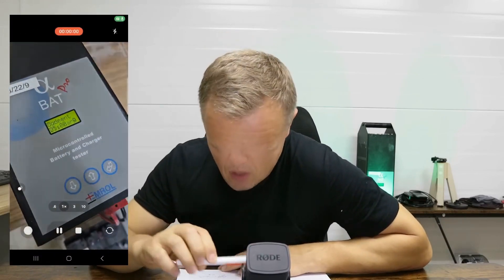For those of you who are viewers, I am posting detailed links to these experiments. I also intend to put the deep discharge battery, our R1 NRG, in the freezer at minus 25 degrees. It should also be shown that charging a frozen battery is a very, very bad idea, because it slows down the electrochemical processes inside to the point where it is practically impossible to charge it. Now that we have discussed all these things, I will show you that this battery has also been cut open, and you can see how it looked from the inside.